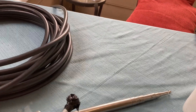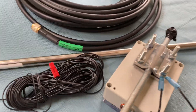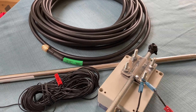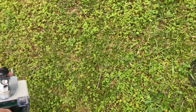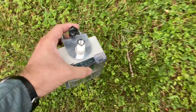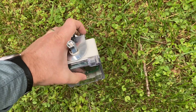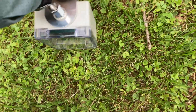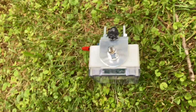That's pretty stiff coax. We're going to run a quick RF safety check and then spike this thing in the yard and see how it performs on the 7300. To be RF safe we have to be about 22 feet away from this antenna - this location is actually over 22 feet. All right, we'll just spike this into the ground.